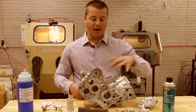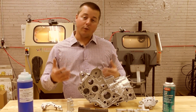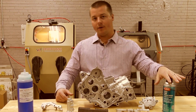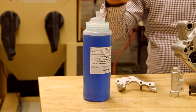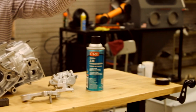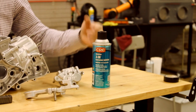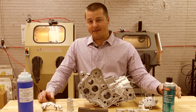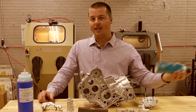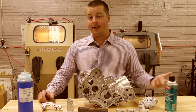This is something you can maintain, so you can keep doing this over the life of this engine or any particular aluminum part. If you see some corrosion develop, go ahead and spray it with this and wipe it down. This is not a lifelong fix — that's just a temporary fix for ferrous metals, and this is good for non-ferrous, your aluminum. And this is lifetime — you can keep doing this over and over. This stuff is fairly inexpensive, like maybe $10 to $12 a can. It's super cheap and it's going to go a really long ways. We've obviously had this for a long time, and we continue to spray this every day if we need to.